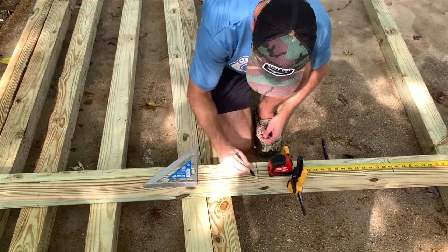Continue to glue everything together, but before making the final connection, you wanna make sure that you thread your cable through the conduit and into the shed as you're seeing now before you make that final connection. So as you can see, I have the cable threaded through and now I'm gluing that final connection 12 inches below grade. And now I'm just going to apply a little bit of construction adhesive to the back of the fitting there, and then I'm gonna permanently insert it into the shed and press it into place.